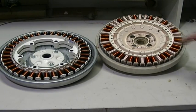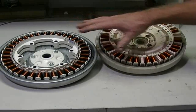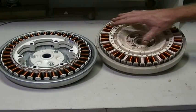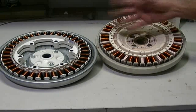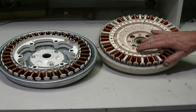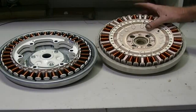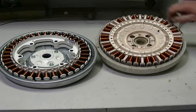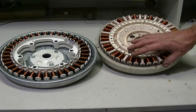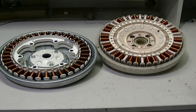In this video we're going to be building an electric outboard motor using a modified washing machine motor. What you're looking at is the Fisher and Paykel Smart Drive motors. They're a three phase motor and an excellent motor for this project, being that they're reasonably low RPM. But because of the diameter of the rotor which has the magnets in it, it produces a lot of torque. So low RPM and high torque is what you want for this project.